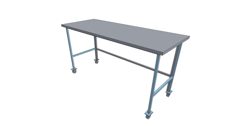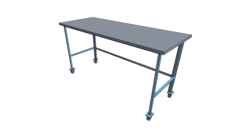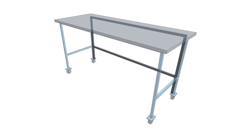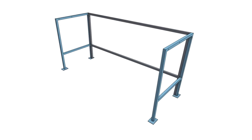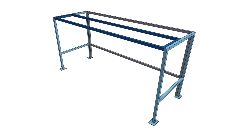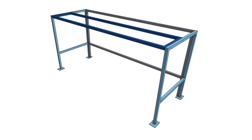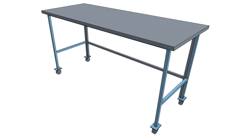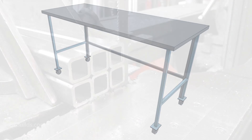The frame's design consists of four basic flat steel frames. These will each be welded up individually and then bolted together — one large frame across the back, two steel frames on each side, and a smaller frame across the top. To keep the whole thing mobile, we'll put it up on four casters. By building the frame in four separate pieces, it should make it a lot easier to move the entire thing down into my basement and then assemble it once it gets there.